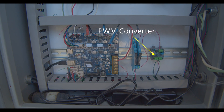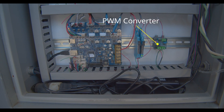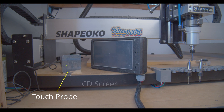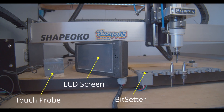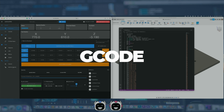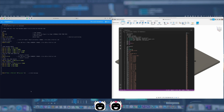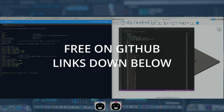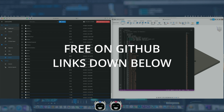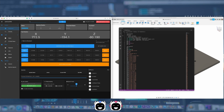Next to the relay is a PWM converter. This board takes the digital signals coming from the Duet 3 and converts them to an analog signal for the variable frequency drive. Lastly, we updated the LCD screen, the bit setter, and the touch probes, and we also added RGB lighting, all controlled by the Duet 3. After all these hardware installations, we moved on to the software. We spent a few weeks rewriting all the G-codes to add support for multiple tool change, the new spindle, the pneumatic hardware, and all the additional accessories. Breaking down everything that we did will take far too long, but we will be giving away all the code and diagrams for free on GitHub. More on that later in the video. But do us a favor and like this video, and if you want to support us, please consider subscribing down below.